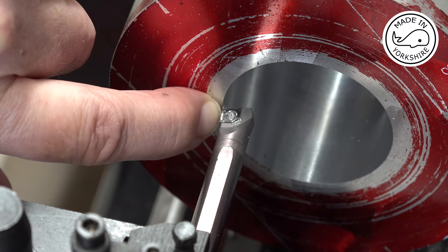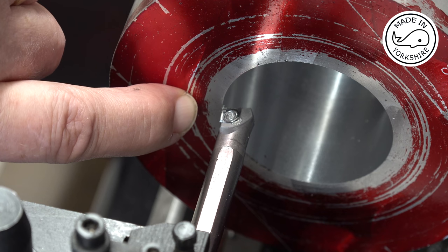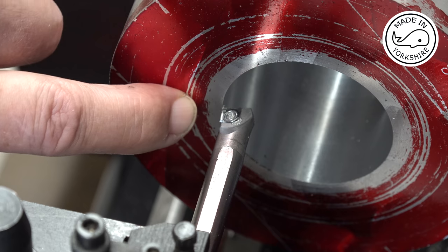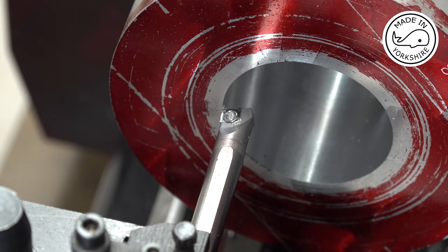And it needs to be opened up to 2.26 of an inch. So if I take 2.126 off that, I get 134 thou. Divide 134 thou by 2, I get 67 thou, which is equivalent to 1.7 millimeters. So that's one full turn of the dial and 36 increments.